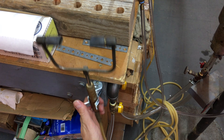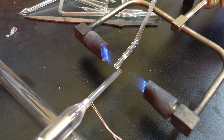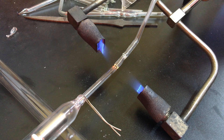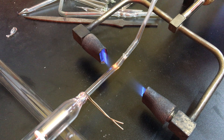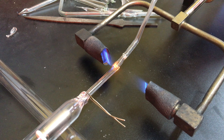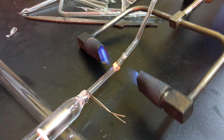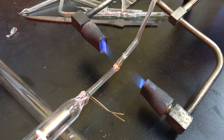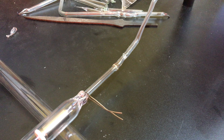A portable hand torch allows me to take the fire to the processing bench to weld the tubulation. This blow hose will be used to keep the tube from collapsing and to work the weld. In my effort to avoid blocking the camera, I am unknowingly holding the top burner of the hand torch closer to the tube, causing it to be heated unevenly. You can see I almost blow a hole in the side of the tube before I realize the error and reposition the torch. Crisis averted and the weld looks like it should hold.